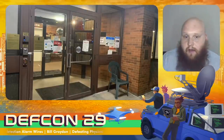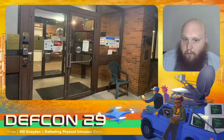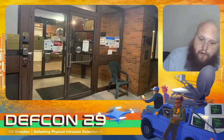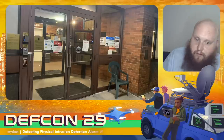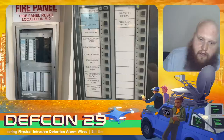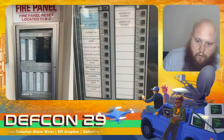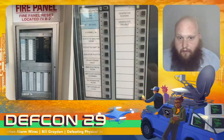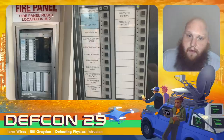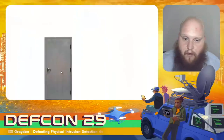You can see an example of alarm zones with fire control systems. They are a lot more publicly viewable than security systems, and in the foyer of many large buildings — particularly with western hemisphere fire codes — you can look at what the zones specifically are: is stairwell number three having a fire alarm, are various monitored aspects behaving correctly, and are the wires intact? All of that will be displayable there.